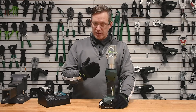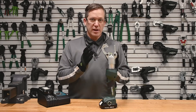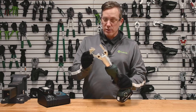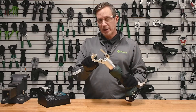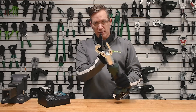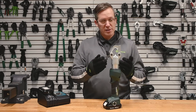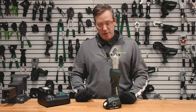What's really unique about this is that it is a flip-top orientation which gives a very controlled termination. When you're using a flip-top tool, always put the termination into the cradle of the latch of the flip-top, making sure that it's properly secured from shifting and eliminating any movement. Once you have that, the tool takes over, applying the appropriate force based upon the overall size and nature of what's being put into the head.